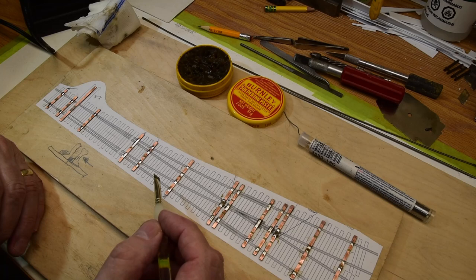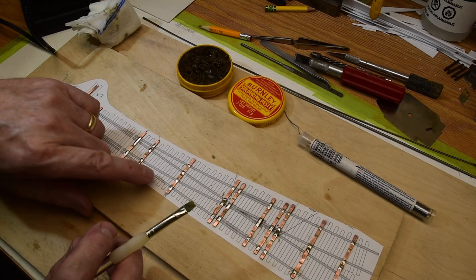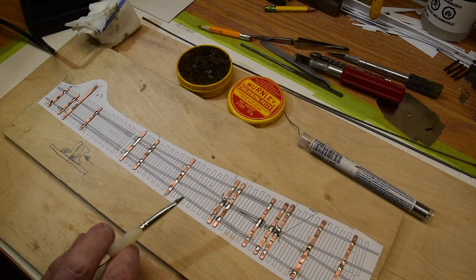Well, you're going to clean it with isopropyl alcohol anyway. That's what they clean all PC boards with, in an isopropyl alcohol bath. So if you want a really good chrome, a high chrome solder, that's because it's clean. If you get a sort of a dull gray, you know it's a cold solder. It's going to fail eventually, right? It's a poor solder. So use paste all the time, right?